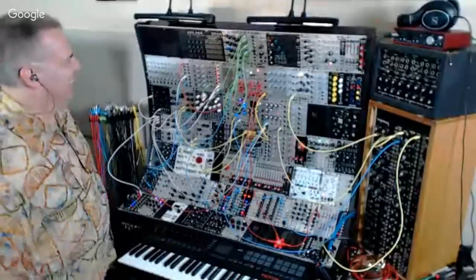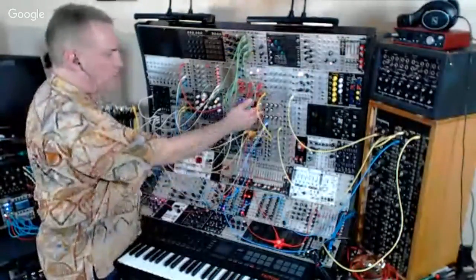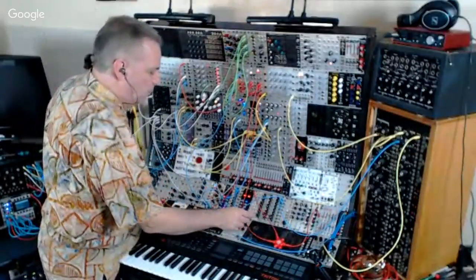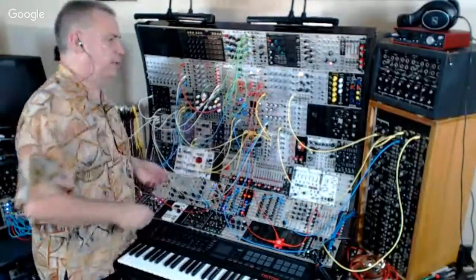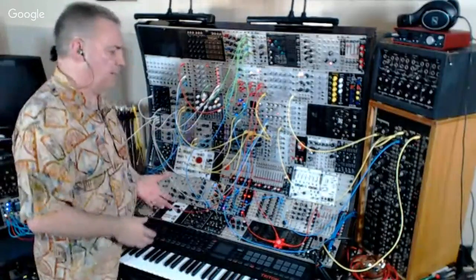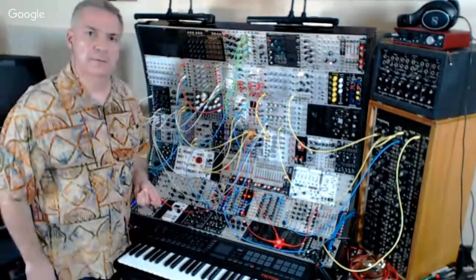Yeah. And I think that the right utilities would stop people selling things so much, certainly as my utility section has grown. Because when a module doesn't necessarily do what you want it to do, or maybe the peak of an envelope won't fully open your filter, having the right utilities lets you make it do what you want and scale it for the rest of your system and your approach. It's a very simple thing here. Like, I want the filter to have more of a bite, so I'm taking my filter output and running it through one channel of the Levitate just to amplify it beyond times one, to get a much harder spike to hit the cutoff frequency of the Evolution. Just things like that. Otherwise I'd have to compromise my voice, or I could say, you know what, I really want this voice to do this, and utilities will make me do that. Yeah.